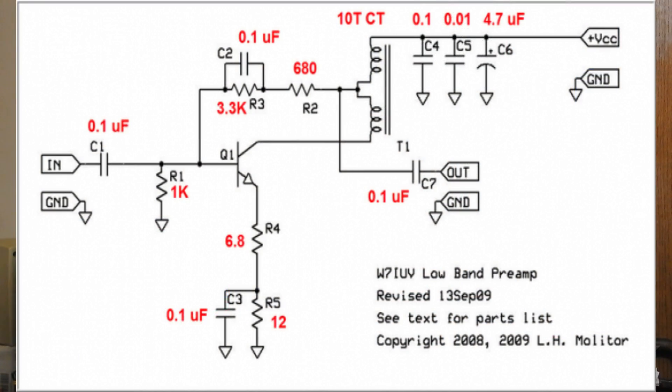Mine is an active receive antenna. It's not a magnetic loop — it's not coupled, there's no separate coupling loop to the main loop. It is simply a single loop of wire once around with a preamp. I have the W7IUV preamp hooked up to the loop. Here's a schematic for the preamp — it's real simple, a single transistor circuit. Plenty of designs out there if you want to build your own.